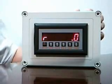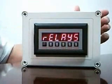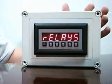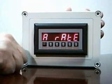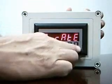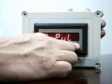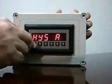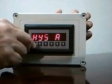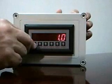I can now go in and change some of the other menus in a similar fashion, one menu group at a time. Pressing the program button, I'll go to the next set of submenus, which are titled relays. I'm going to set these up to be rate alarms. I have selections here where I can determine how each of the relays is used. For the A relay, I have selections that it can be a rate alarm, be assigned to total, or to be a pulse output. I want to use in this application my A relay as a rate alarm. So while that's displayed, I'll press enter. It now allows me to set a hysteresis for that A rate alarm. In this case, you'll notice that the hysteresis is set to one.